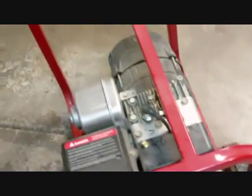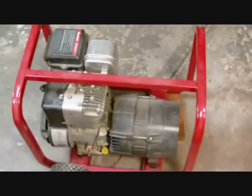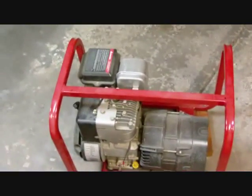You can see that this unit has started. I need to open the garage door here. I made just a couple of attempts, set the choke right, and this generator fired right up, just like it would have when I got it. So it's just a tip for YouTube viewers: when you're working with an old piece of equipment that runs on this type of setup, you're going to have some corrosion and light rusting — that's normal. And if you don't remove that, you probably won't get a spark to start this gasoline-powered engine.